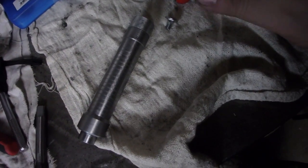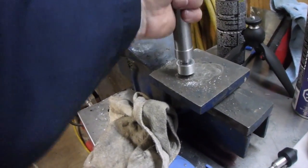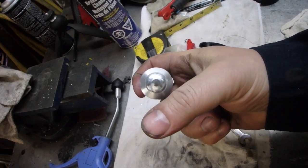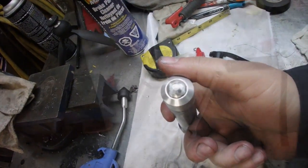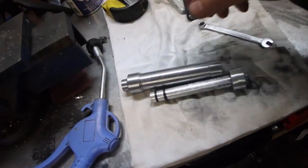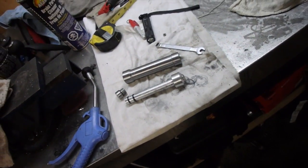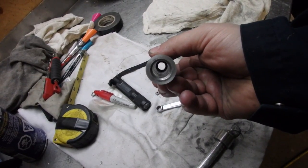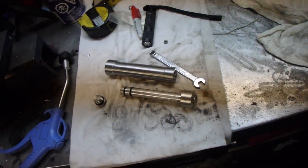Well I got it completed. I'm just going to put some red Loctite on the threads and then we're going to screw it into the bottom. There's lots of compression in there as you can see. So this is the final look of my fire piston. The o-ring top, got a stove bolt in the bottom because aluminum is soft so you can smash it down on something. Got the double o-ring and a hole in the top - put your char cloth in. Would have been cheaper to buy one instead of the time it took to machine it, but that's not the fun involved. I will do a video of the char cloth once I get some made up. And we'll put this to the test - if you guys have any questions or comments post them below. Thanks for watching.